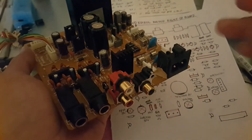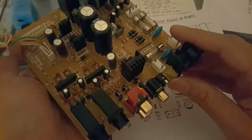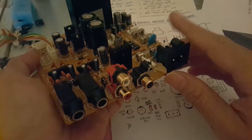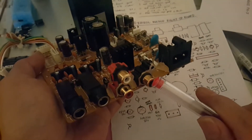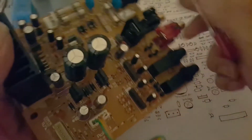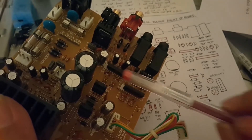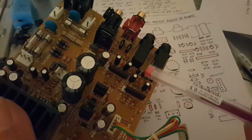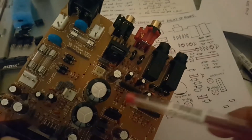After several attempts to repair this speaker I finally succeeded. The problem was no input and no output to the left speaker. I already changed the op-amp IC — this is an operational amplifier IC responsible for amplifying the signal. I also already replaced the NJM IC and it still didn't work, so I decided to check the neighboring components.